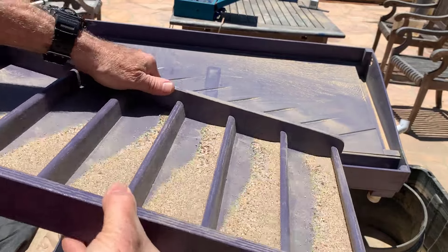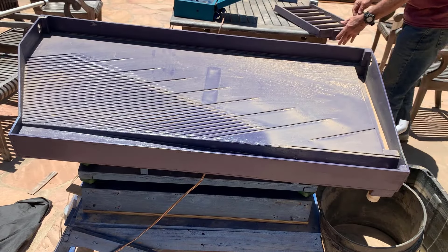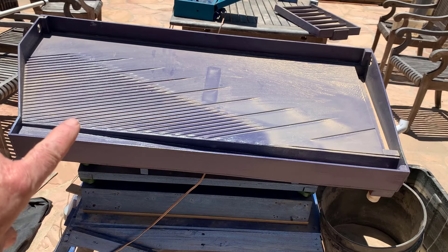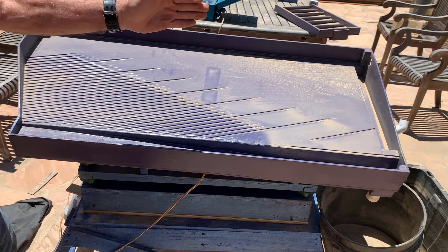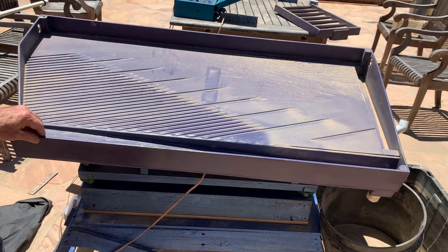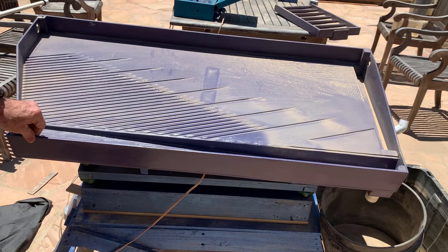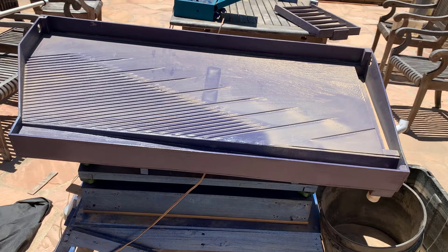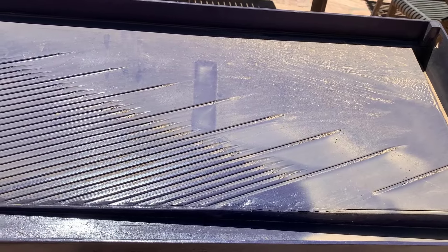After playing with this for a few days I don't really like it and I don't know how to make it any better. So I thought I would get this table out to see what it will do. This table bumps in the direction along the grooves — it works really well for wet concentration, and now I'm trying to see if it'll work dry. The bump rate is five and a half Hertz and I'm at 60% of maximum amplitude.